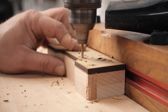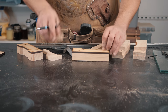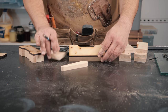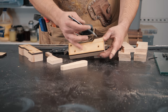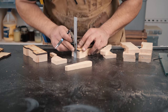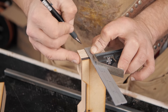Okay, so I've taken off my templates, except for the last thing you wanna do on the lower jaw, which is the one with four holes. This is where the cantilever guy is gonna go. These two holes are what is gonna allow it to slide up and down. And then this one here, I kept for alignment, and that's also gonna keep the wood from splitting when we release this kerf here. So what you wanna do before you take this template off is very carefully mark where your kerf goes. That way, when you have this put together, you can cut it all at the same time, and that way you don't have any pieces that are still stuck together.